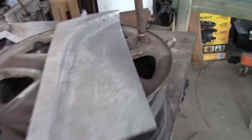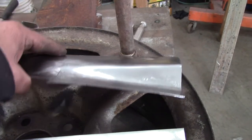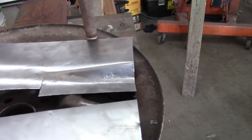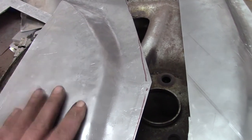I'm going to start on this one. I didn't have the profile correct and I already fixed it on this one — you can see the difference because it just flares out on the bottom. I made my snip, I'm going to hammer that out flat and make the bend more severe to match that one. Due to slight differences in my manufacturing process, with this profile being different than this one, I'm going to have to tune them up separately.